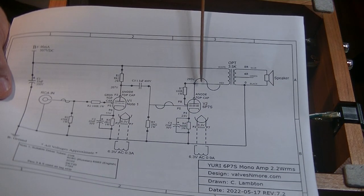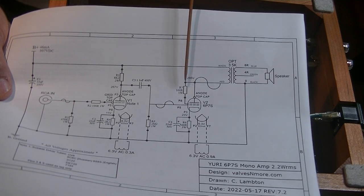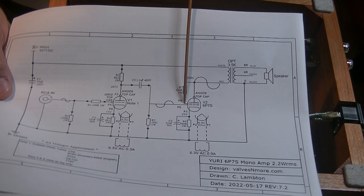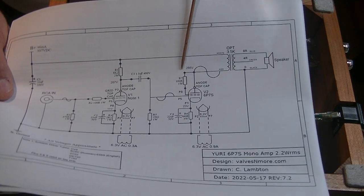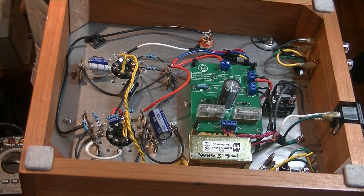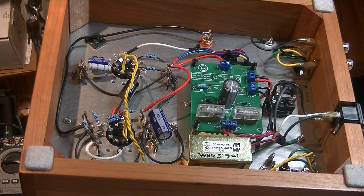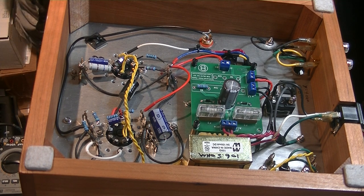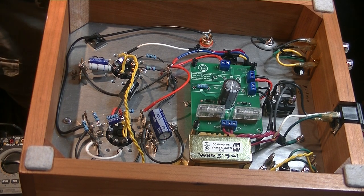I had to take this off of the G2 connection and put in a 100 ohm resistor that connects the high voltage to the plate and ties it to grid 2. At that point we're now in what's called triode mode, and that's all it is. It took me about half an hour and I did both amps. Then we had another listen — and wow, what a difference. In the first 30 seconds we could hear that the music was popping, the bass had recovered, and the music just seemed to be coming out of a black, blank background.